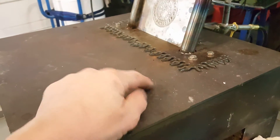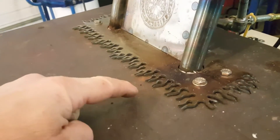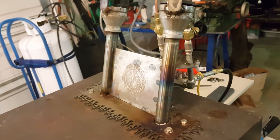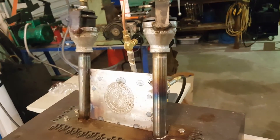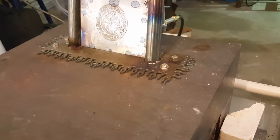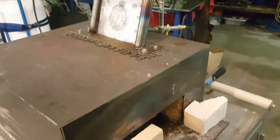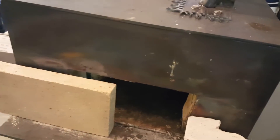The burner turned out really good. The nozzle I was using was a three-quarter inch to one-inch bell, and this one here is inch-and-a-half to three-quarters, then three-quarters to one inch — but I wasn't getting the temperatures I wanted. So I came up with a 1.9-inch outside diameter, 1.6-inch inside diameter stainless steel tube, capped off and threaded to receive the three-quarter inch pipe nipple. The quality of the flame is just very, very nice.